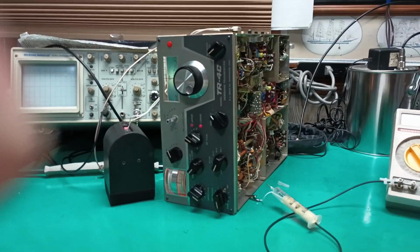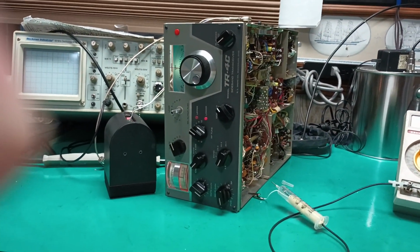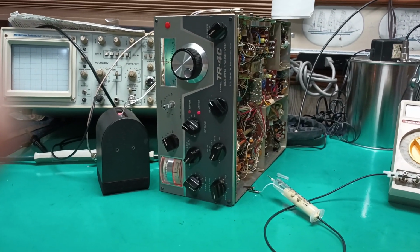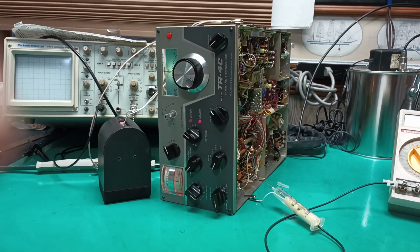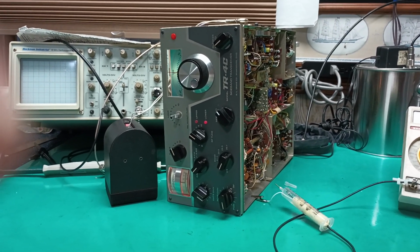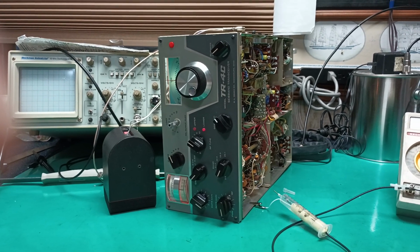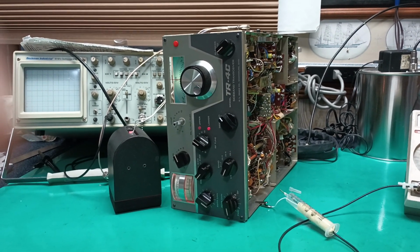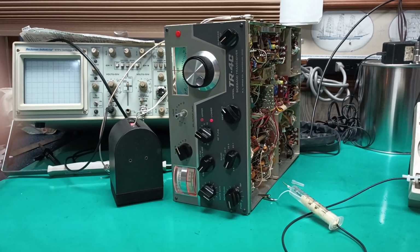I thought about using a clock generator. They make modules, the metal can deals. Most of them, the old stock, were 5 volts. I think some were 12, but a 12 volt supply might not be good enough because I doubt the output is 12 peak to peak. So this is up a creek.